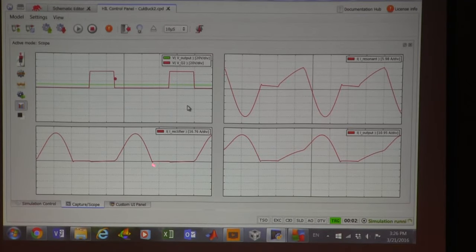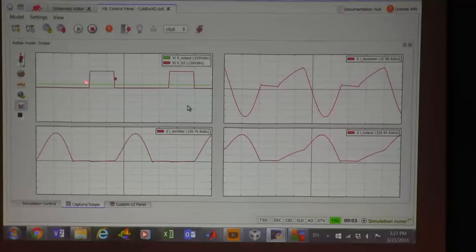When you cut off the resonance early, the RMS current will be larger than if the RMS current is spread over the whole interval. I measured it in simulation — it's hardly noticeable, not even worth dealing with. So constant off-interval is theoretically most efficient, and constant switching frequency with variable duty ratio is just as good.